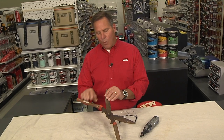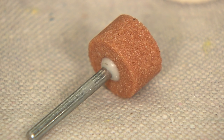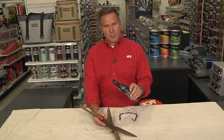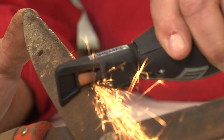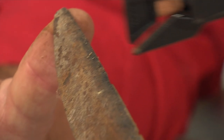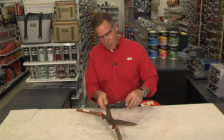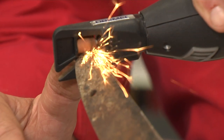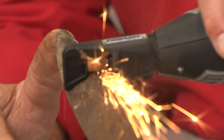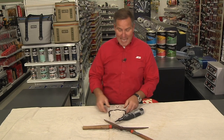Many times people like putting these in a vice, or you can hold it by hand if you feel comfortable enough using the tool. Here's a tip: there's a rotation when you're using a grinding wheel, and you want to orient the tool — whether it's in your left hand or right — so that most of the sparks are away from you when you grind. Place your safety glasses on. You're going to take that gap, that little slot, and line it up into the shear itself. Then go ahead and turn it on and start working back and forth, grinding that edge and getting all that burr off the metal. Do the other side and those shears are going to cut like they did the day you bought them.